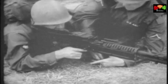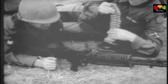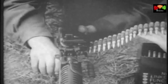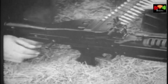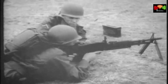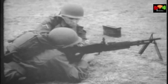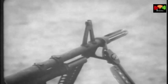Loading of the machine gun is accomplished with the cover down and the bolt forward. The assistant gunner places the first round of the ammunition belt over the belt holding pawl. The gunner then pulls the cocking lever handle to the rear, fully loading the gun. The cocking lever handle is moved forward and the gun is ready to fire. The gunner aims by means of front and rear sights. The front sight is of a fixed blade type. The rear sight is of a folding leaf type and is capable of quick adjustment.